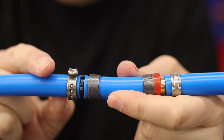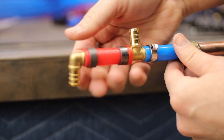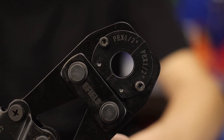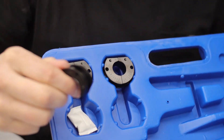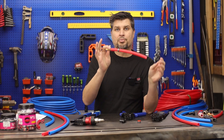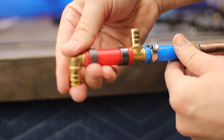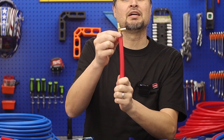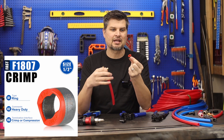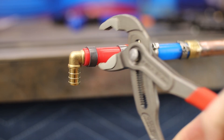As far as the clamp or crimp — for the crimper, you've got a copper ring that slides over the pipe and you simply crimp down on it. With different size pipes you'll need different size jaws. Some tools have them stacked up; mine I have to take in and out, which is a disadvantage when switching sizes multiple times in a project. Per the manufacturer recommendation, the ring should be set back about an eighth to a quarter of an inch past the end of the pipe. It can slide around, especially in a vertical installation. A quick trick is to grab a pair of pliers and just barely cinch down on it to hold it in place while you crimp it. Also, the jaws need to wrap around to the other side of the crimp, so if you are very tight on space, either figure out a way to crimp it before attaching, or you'll need a different system.